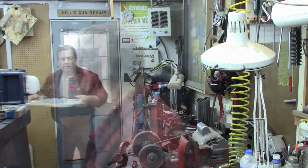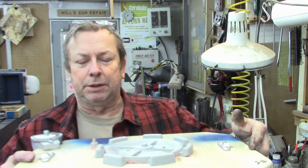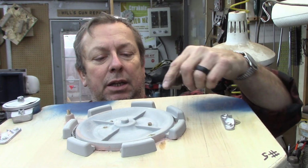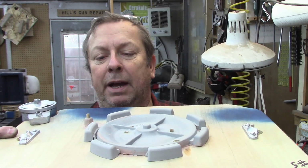Foundry patterns. I've got pieces just set in place on this one. This is going to be a match plate for a pulley, and this is an S7 124 pulley for the Atlas Shaper, and I can't tilt it all the way up because I've got my little riser cups here just set in place. I've got one of them that was part of the pattern.